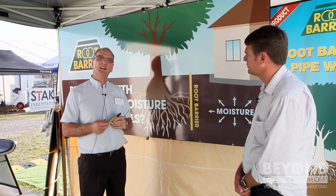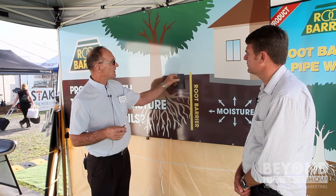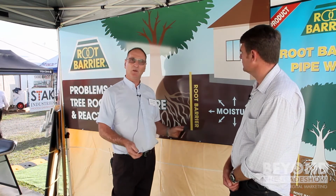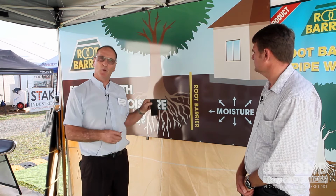To get a structure down there that doesn't break, it would have to be basically a structure that's fully engineered like a dam wall. It would have to be 450 wide, double fully caged and tied with 16 mil bar. In other words, a full-blown retaining wall before it would keep that head pressure back, because you're talking about an unsupported structure in the ground because this side's drifted away from it. And that's the challenge. So root barrier flexes.